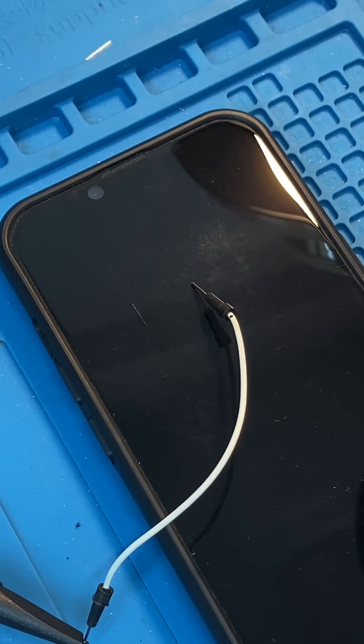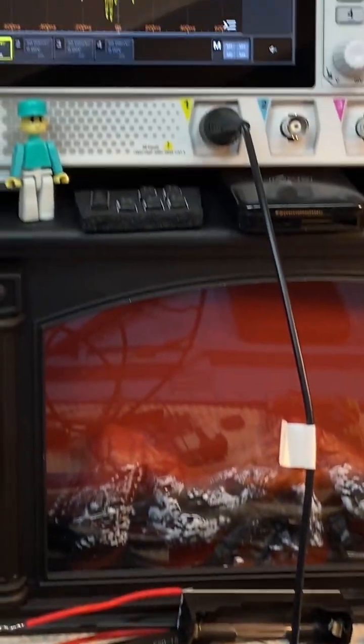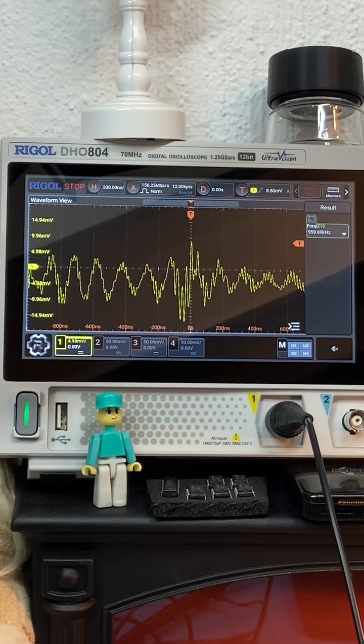What I've got here is an iPhone on charge, so it is connected to earth because it's plugged into a USB port which is earthed. That's common to the scope as well, so we don't need to earth that probe — of course we know it is earthed because the scope is earthed. What I'm doing is sniffing for the capacitive pulses that are present on the screen of the iPhone.